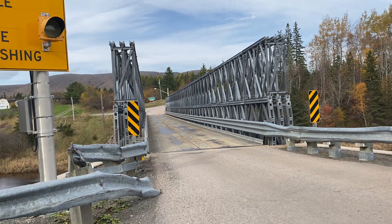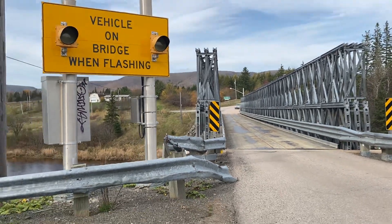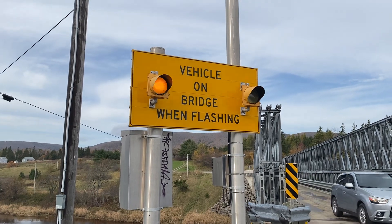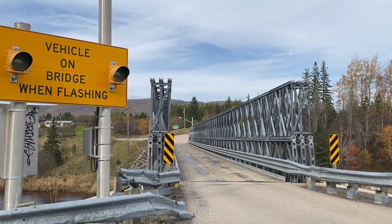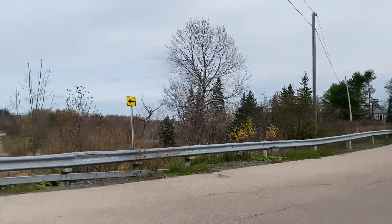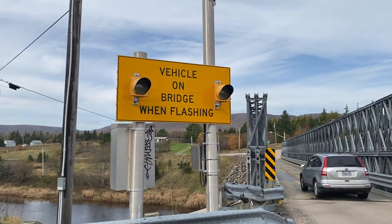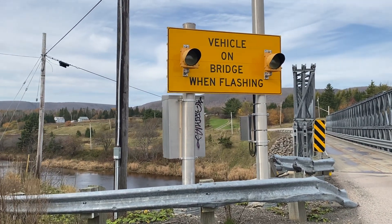Let's see if a car actually does come down here. Like I said, it's not much traffic — oh yeah, here comes a car now. There you go, that's exactly how it's supposed to work. When the vehicle gets on the other side, it gives them a heads-up for the blind corner. As this car goes through, this side won't flash but the other side will, until they finish crossing or go out of range of the Wavetronics.